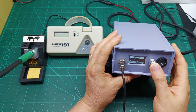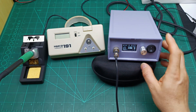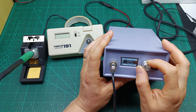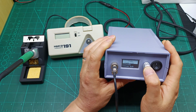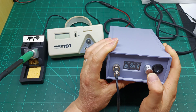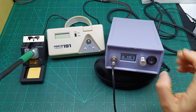I think I have a problem — the station is not going into sleep mode, which means I didn't memorize the Sleep Time correctly. I go back to Times, press once, and I can see Sleep Time is set to 1. I need to bring it to 0, press it, then exit — and now it's in sleeping mode. Make sure you don't leave a different number there, otherwise the sleep function won't work.